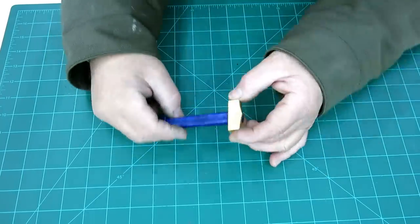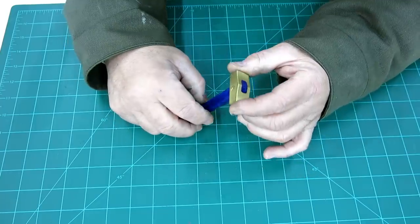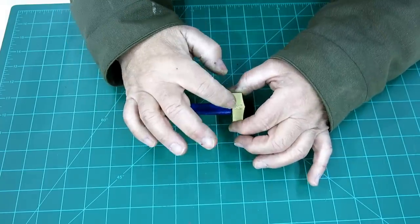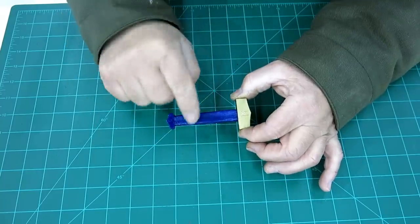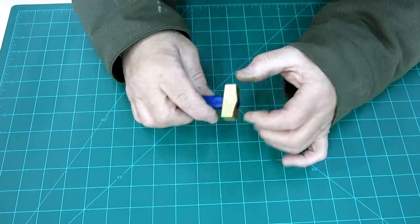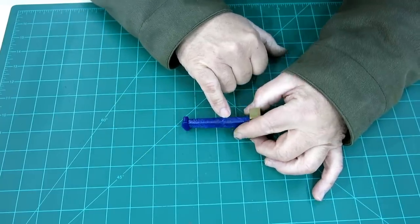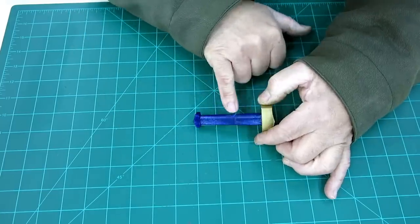And this particular thing here is a little hammer he made, and it was part of his mold making apprenticeship or a mold making training class. The head went into the mold, and then the handle was injection molded with this in the mold. So there's some features internal to here that lock this plastic into the head there. You can see there's an ejector pin, and there's where one of the gates was. It looks like it only had a single gate here, looking at the pattern right in that area there.